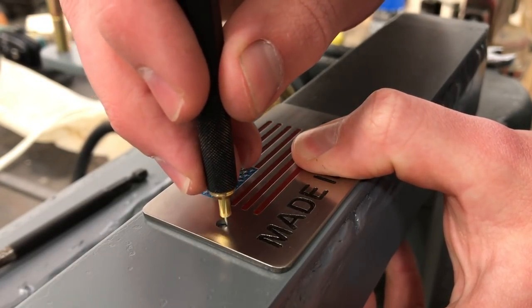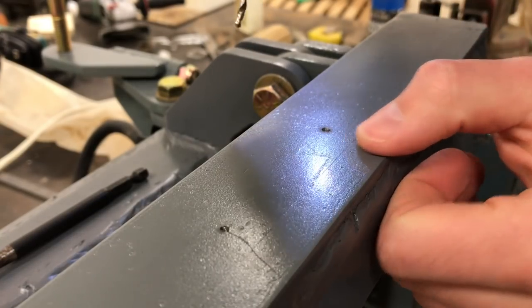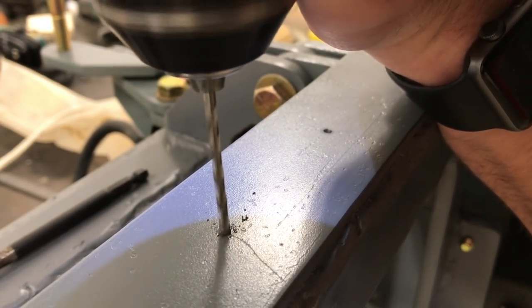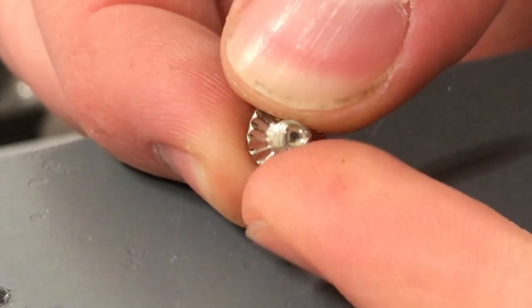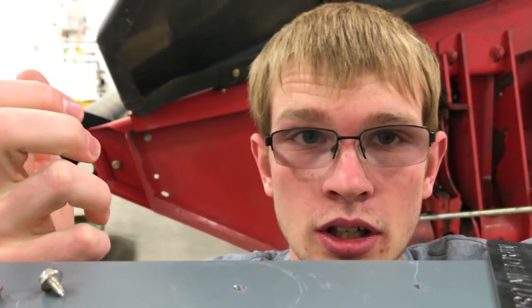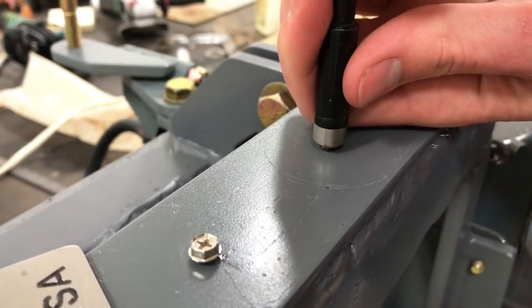I've got this positioned exactly where I want it, so I'll just mark it and drill there and there. I'm not going to drill all the way through because there's actually a part that slides inside this tube, and these screws are very short so they don't need to go through. I was concerned this might happen — I think because I drilled it freehand and was a little wiggly, it drilled a little too big, so now the screws just fit in easily. I guess I'll have to drill it out and use bigger screws. These are the same sort of screws — you can see they're kind of triangular, I can feel it spinning in my hand. I'm also going to put a drip of oil in each of these so it'll work a little more like a thread-forming tap. Okay, that one works really well. This one actually seemed like it bottomed out.